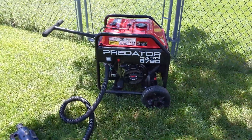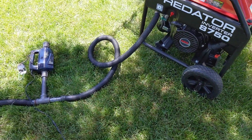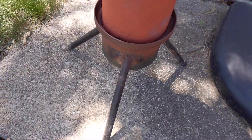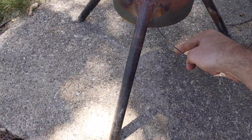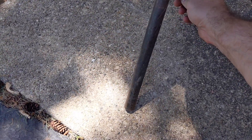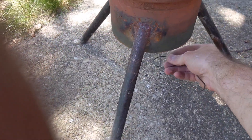I'm running the generator out of gas — there it goes, it just ran out. So I'm going to get the gasifier fired up and see if we can get it running on charcoal. I don't recall exactly how I left this gasifier, so I'm going to stick this piece of metal in to see if I can get the charcoal visible and clear away any ash, just so that it can ignite.